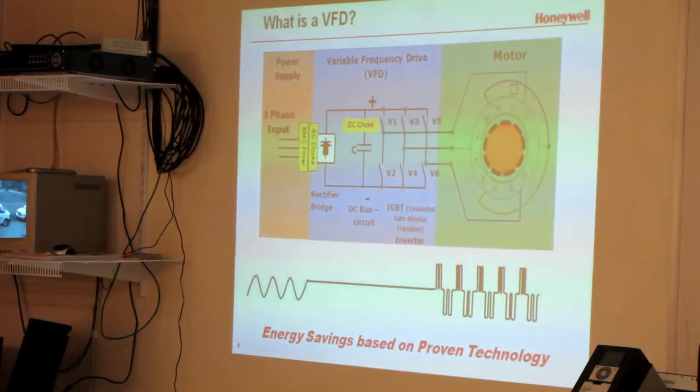The drive then gives you pulses, anywhere from 1,000 Hz to 16,000 Hz — that is adjustable. The default values that come with it are the most efficient for that motor size. For a 10 horsepower motor it might be a 5,000 Hz carrier frequency, and for a 30 horsepower it might be only 3,000 Hz. That carrier frequency is adjustable if your motor is humming or buzzing. I don't recommend changing it, but if needed it's available as a parameter.